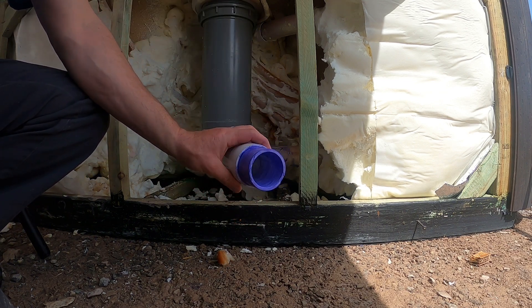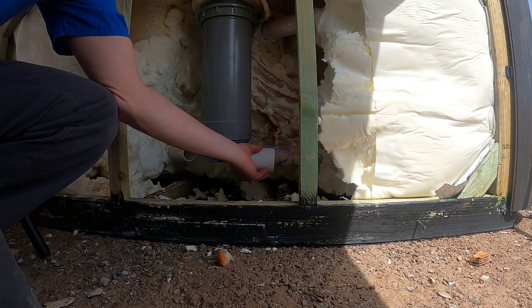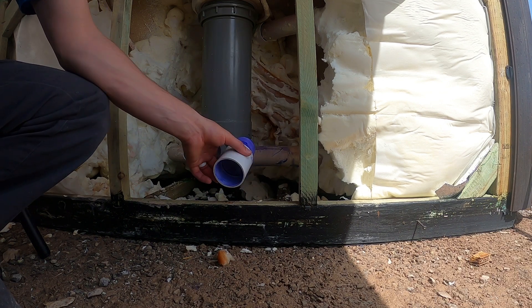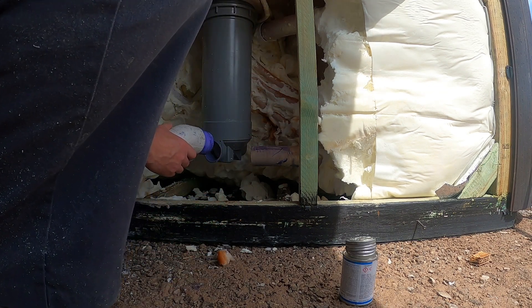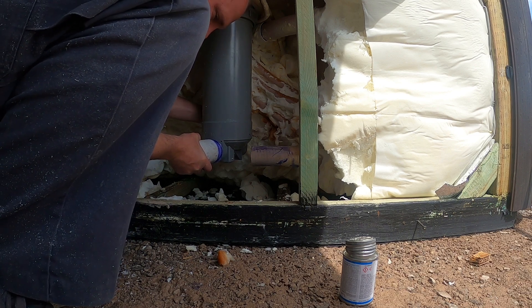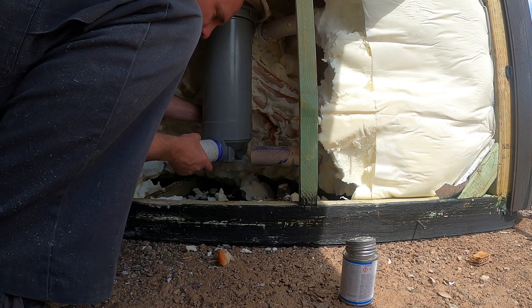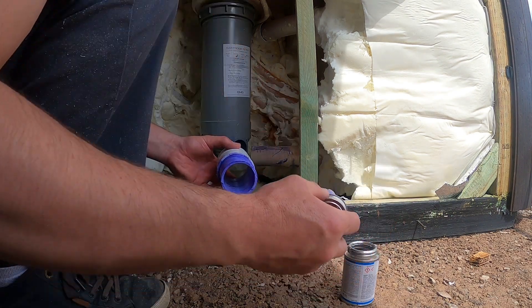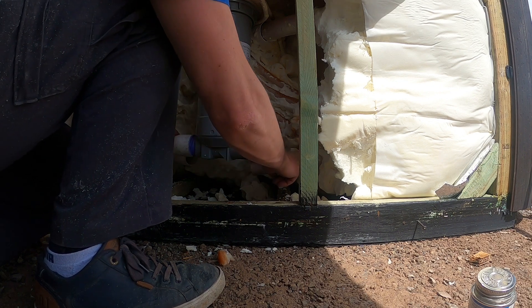I'm going to turn it around and then take a two-inch coupler — I've already got a piece glued in on that side. I'm going to stick that on the other side and then turn it and line it up with the plumbing over here. I can make a measurement, make a line on my pipe, trim that back so that these two can glue into those pipes. Put some glue on that side, get some glue on this side. I'm going to stick this in, twist it as I'm going in, and hold it there for a minute because I want that glue to set up before I let go. Sometimes when the glue is trying to set up it can push the pipe back out again and then you have a weak glue joint. Same thing over here — spin it as it goes in and hold it in place. I'm still not going to tighten up the nut on top until I get these parts put in place.